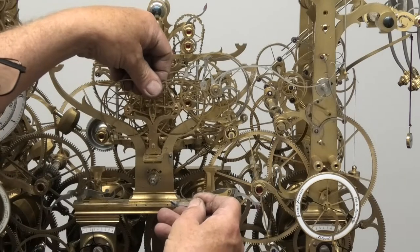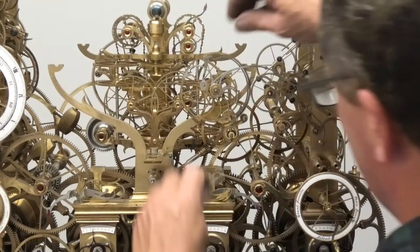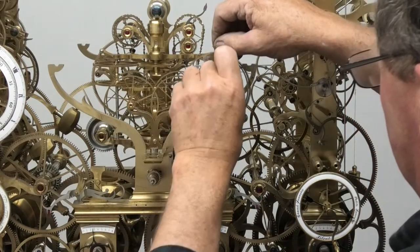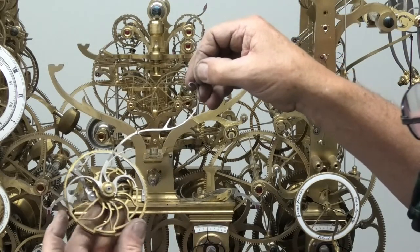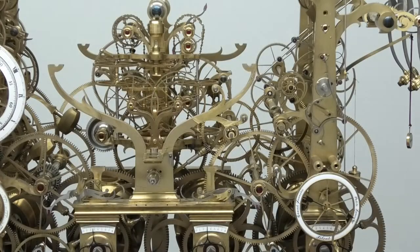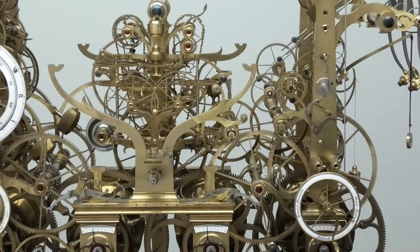And the second anti-frictional wheel assembly is removed. And then it's a taper pin and washer. And then the whole strike snail assembly is removed. And that's all that is needed before the main sections can be separated.